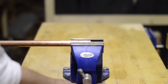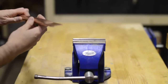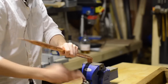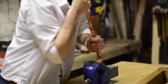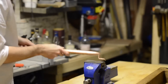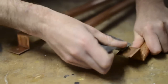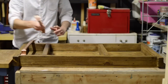The copper pipe is pretty soft and very easy to work with, so I managed to flatten the ends just using the vice. Then I put it back in the vice and give it a 90-degree bend in one direction, then reposition it and give it another 90-degree bend in another direction to make a little tab to screw up to the rack. The tabs just need holes put in them for screws to go through, and any burrs or rough edges get a little clean-off with some emery cloth. Now the rails can just be positioned and screwed in place.